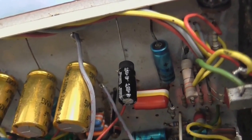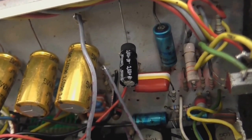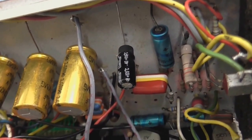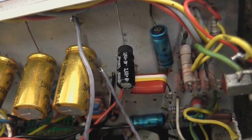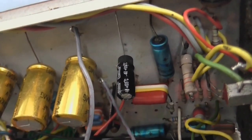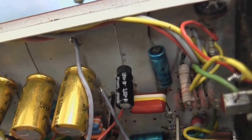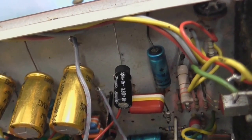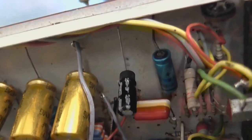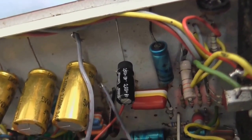I'm a little perplexed as to why that happened, because the original capacitor was a 33µF rated at 16V. The replacement was a 47µF, also rated at 16V. Although I didn't use the same capacitance value, I know that's perfectly safe since this is just part of the power supply. But as you can see, this one has also popped its top. It is a cheap capacitor, so I don't think it could handle anything near what it states it can.